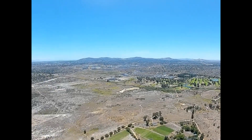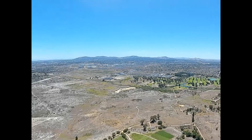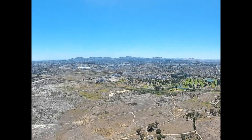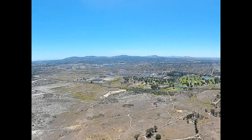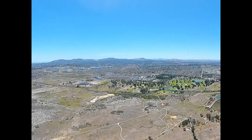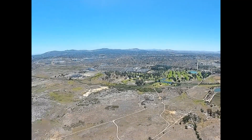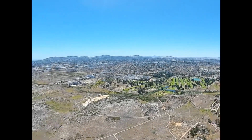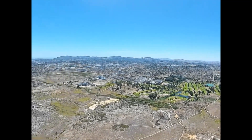I'm running Betaflight 4.4 — fantastic! If you have not loaded Betaflight 4.4, go do it now. This GPS rescue is cruising back on the default 15 kilometers per hour. I updated it to 30 kilometers per hour as soon as I landed, but this saved my quad. Betaflight 4.4 is really really fantastic. Yes, 4.2 and 4.3 would do the same thing here, but the way 4.4 just operates is really really nice.